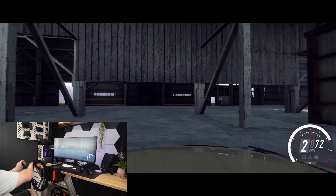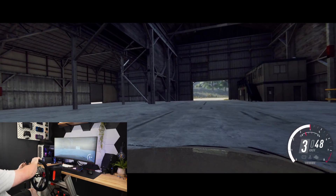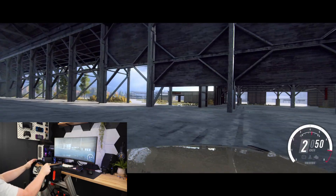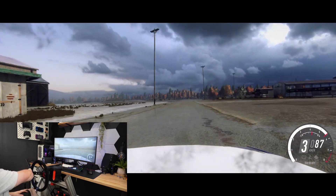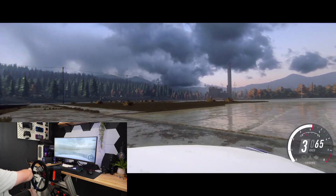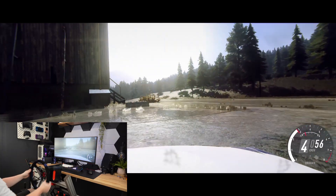Okay, let's catch it. Well, one thing is for sure — much more practice is needed on my part to be any good at this. The handbrake is working nicely though; it's in a good spot and it feels pretty convincing to use, so I'd call that a win. The spring does feel a little soft compared to the pedals because we have so much more leverage with this design, so I'll probably pick up a heavier spring to compensate. I've tried pulling on the brake as hard as I can manage with one hand and no amount of effort has caused any issues, so I think it should be pretty solid for a long time to come.